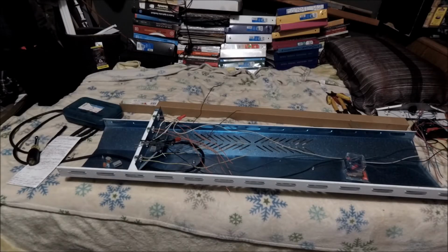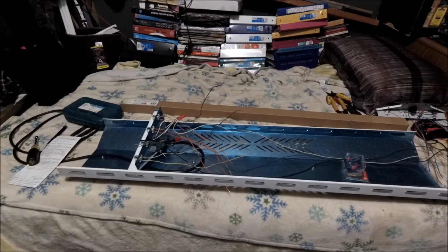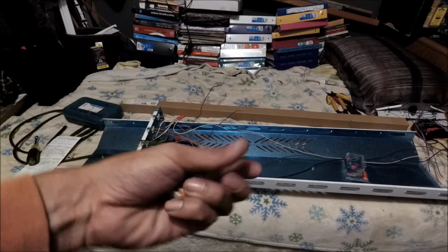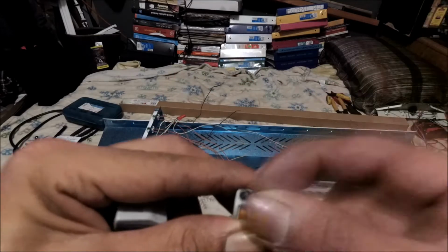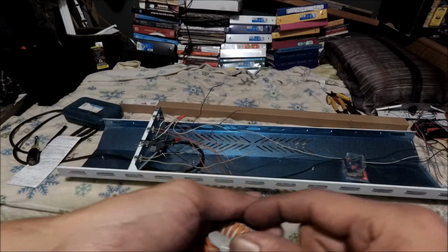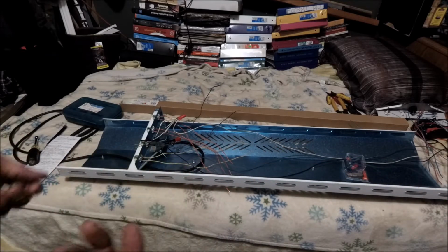All right, my peeps, I'm back. Took one little break. So the reason why it took a while rewiring all of those conductors, I was literally trying to reuse these, but when I was inserting the conductors, they weren't really clamping on. They were just loose connections. So I apologize. So pretty much I did a 6-way pigtail or splice just with a wire nut.